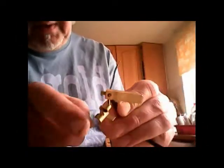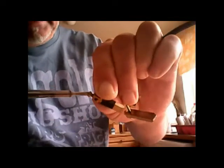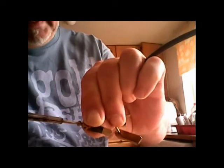Yeah, I've already connected two of my ends. There's my brown on there, there's my yellow and green on there, and I've just got the blue one to do. So I take my blue, make sure you work out which way the wire has to go in so it fits back in the plug properly. Just poke it in the hole, give the screw a little turn with your fingers, tighten it up with the screwdriver like that, that's it. Now you're ready to just put your plug back together.